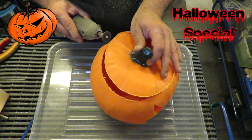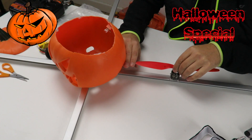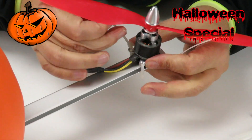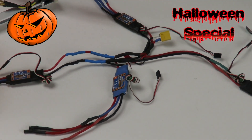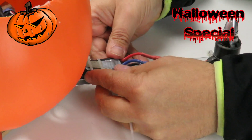The pumpkin has been prepared by cutting off the top to get easy access to the flight controller later. It can now be mounted on top of the frame with some wooden screws. Four holes have been added with a soldering iron to allow the speed controllers to be mounted easily. Now it's time to install some electrical components. Let's mount the motors and make sure the props clear the pumpkin head — in this case, 1-inch clearance with a 10-inch prop. Now we can cut the arms to the right length. The motors are attached to the arms with double adhesive pads and secured with binders. Next we install the wiring harness including the speed controllers. The circuit is quite simple where all the black wires and red wires are soldered together. We attached the speed controllers the same way we did with the motors. It's a good idea to keep them away from the flight controller because they are quite noisy and can interfere with it.